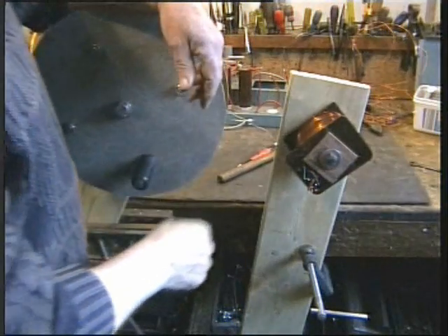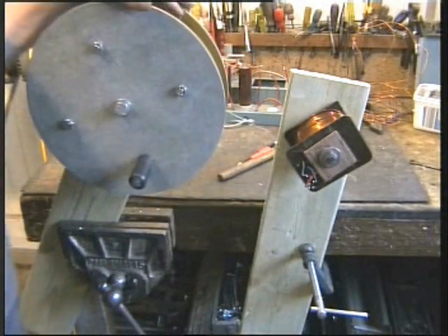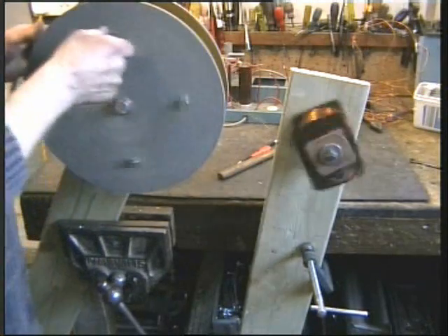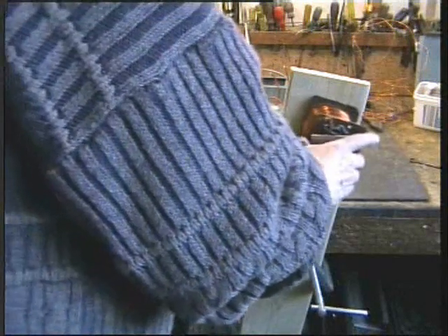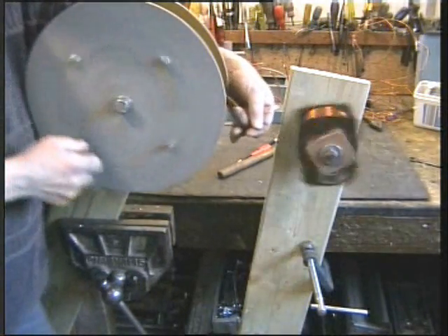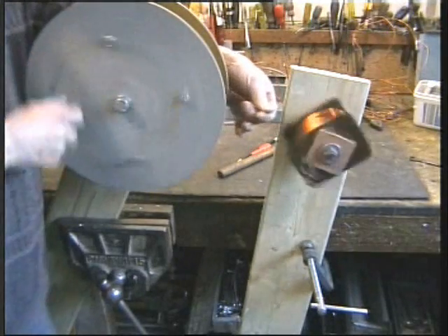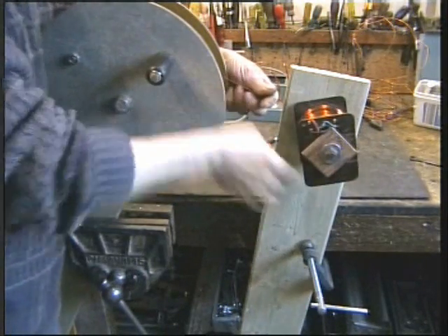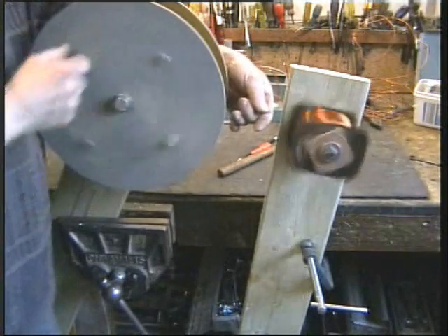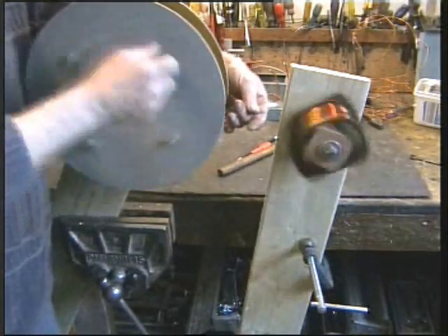What I've done here, I've cut a piece of wood to fit the inside of the bobbin and put a nut and bolt to a plank which I've clamped to the bench. And I've got my mackerel gurdie wheel here, just temporarily to wind the copper on. If I go this way - yeah, that will work. Let's try it. Yeah, that's okay. Take your time, this will do it. Get rid of some insulation there. Mind you, if the enamel is all burnt off I'm wasting my time, but we won't know till I get further in. Winding away - this way it won't kink and I can reuse it. Well, that's a theory anyway.